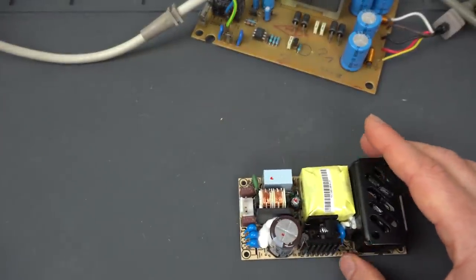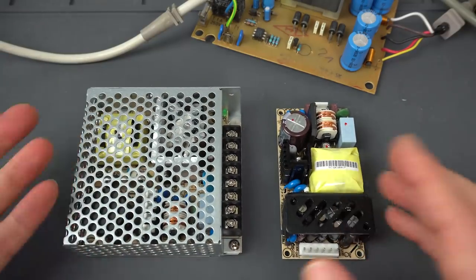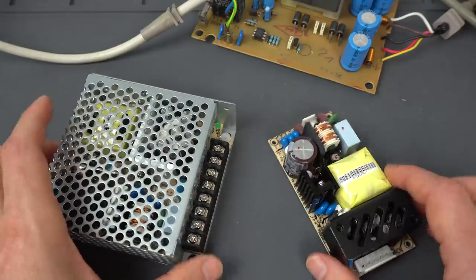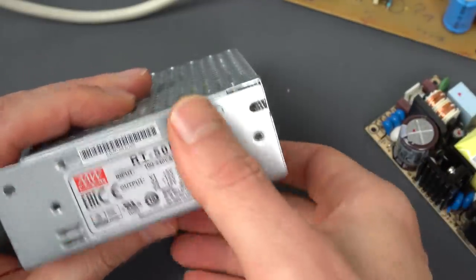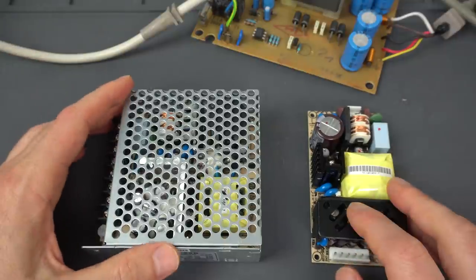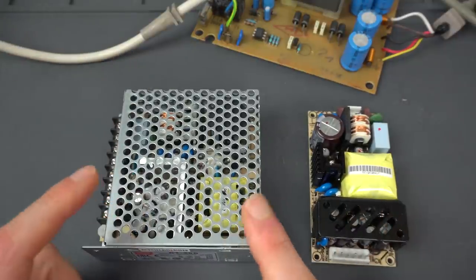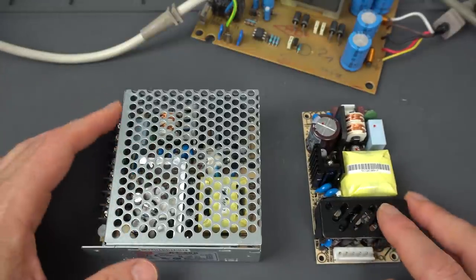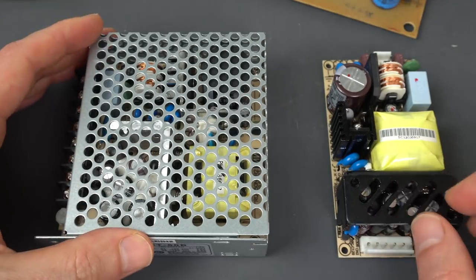And so for that, we have multiple options. But I generally like to look at Meanwell power supplies. They're very well done, they're reliable, they're not likely to explode, so all those are good things. And these particular ones, they output those 3 kinds of voltages. Also, another requirement for us is that they both work with 220 volts and 110 volts. So they'll be good both in Europe and the US and pretty much anywhere else in the world, which is one of the main things that we want out of this transformation of the power supply.